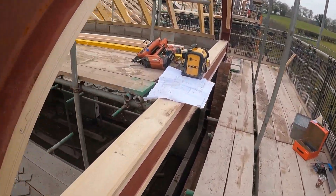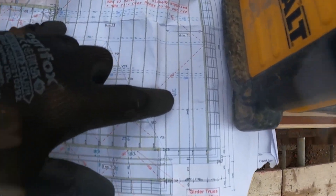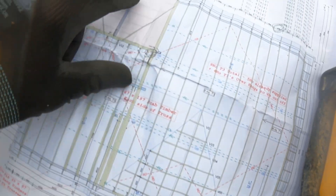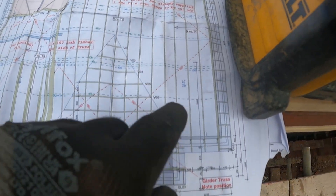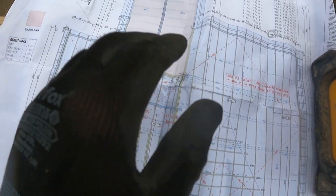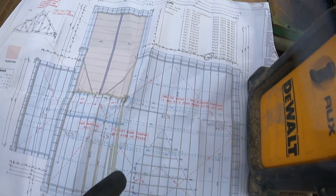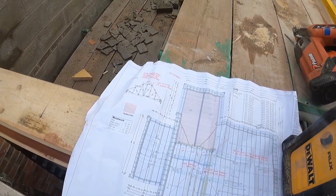I'll show you now. So this main bit of roof — you see that there — 31.5 degrees, and then the back section is 45 degrees, so it literally tells you your details. We need this roof here because we're bringing the rafters in on top of that, so we want the angle of this roof. So we know our seat cut is 58.5 degrees.